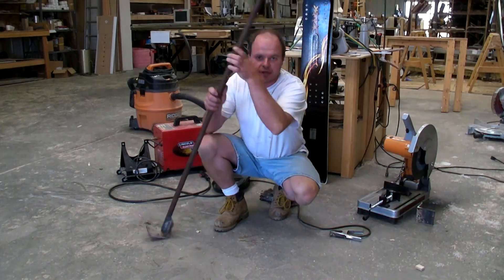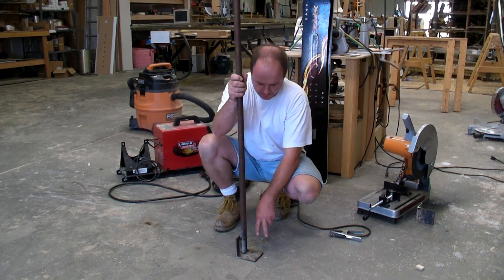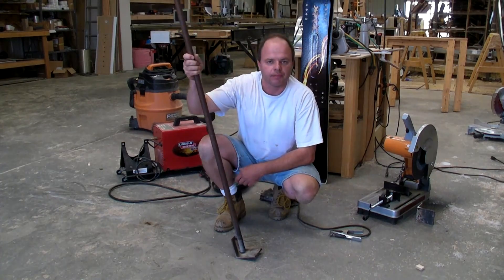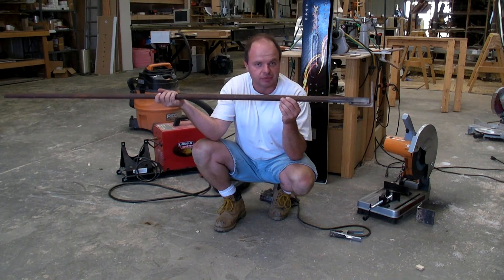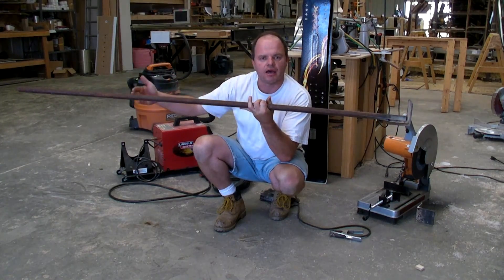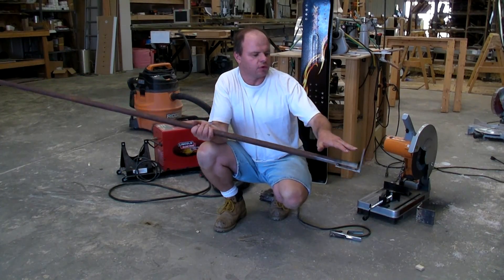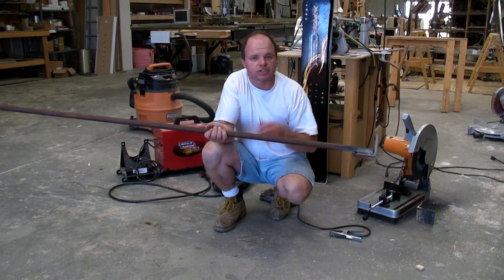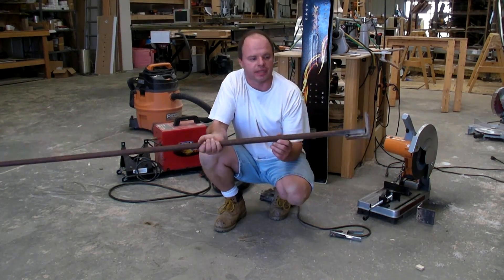So what I've just welded up here is pretty simple. It's really just a lever arm. It's got a four-hole pattern in this plate down here, and then I've just got this big old lever arm. It's all bolted onto a board, mounted sideways to something very, very rigid. I'm going to start hanging weights off of the beam here, and we can calculate what the forces are applied to the inserts, and therefore know sort of what's going on in the board, and see how things are reacting with the rest of the plate system.